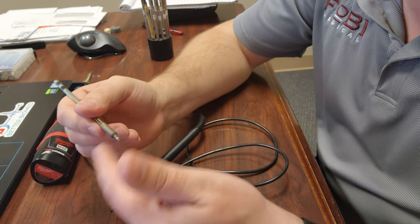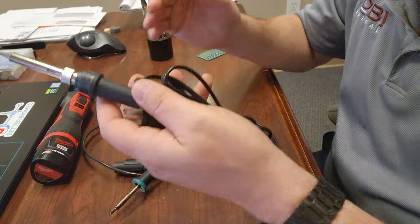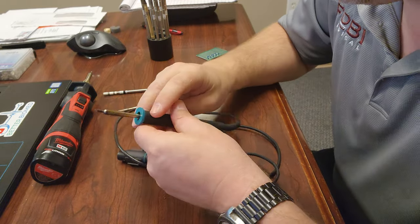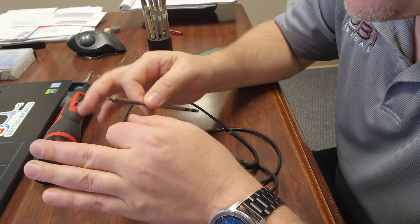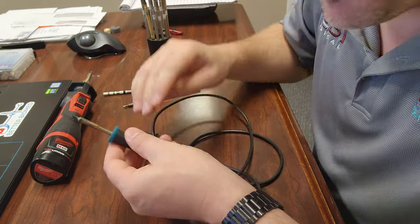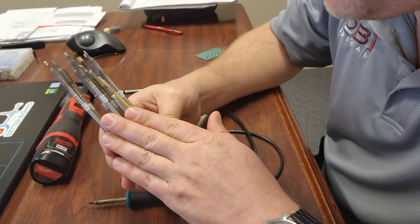It's got a reasonable amount of thermal mass — it's only a three millimeter, but this is easily one of my favorite tips. If you're looking for a soldering iron, these older ones might be okay if you're getting started, but if you really want to work on some good boards or larger PCBs, you need a higher wattage soldering iron — one that's 70 watts or more — and get some good tips and keep them maintained. These ones here you can see are a little dirty; this one's tinned, and when I tinned it, it cooled down naturally and gave it that charcoal look. Once it heats back up I'll clean it off and I'm ready to rock and roll. Tin your tips, take care of them. If you have corrosion on your tips like these ones here, think about getting replacements because I probably wouldn't trust these for serious work.